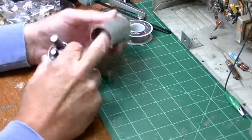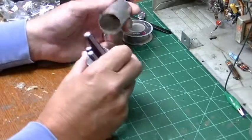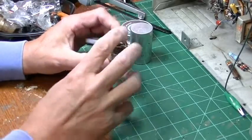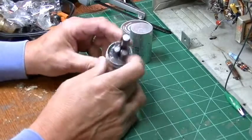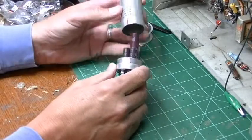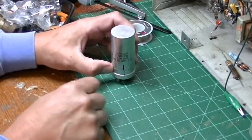Then I clean out all the insides of the electrolytic can, which usually has a big piece of tar in it. I heat it up with the heat gun, sometimes use a corkscrew to pull it out, sometimes it'll pull out on its own. Then I clean the inside of the can, then come back and drill some holes for the leads to the new capacitors, get them soldered in, get them mounted, and then come back with hot glue. The caps end up pretty firm.